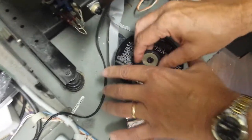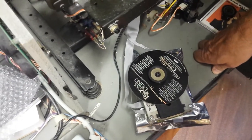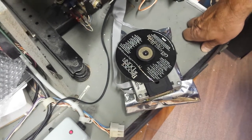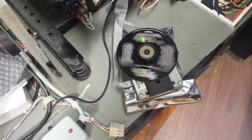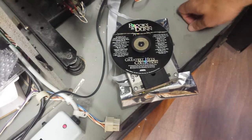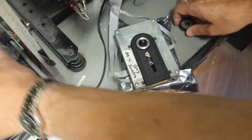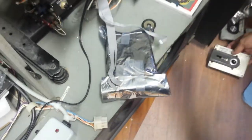We're going to put the CD back on and select the same track. You see what it's doing? It's stopping, spinning slow and stopping, spinning slow and stopping. It'll do that twice and then cancel the CD. That's a sign that you have a bad CD Pro player — it's probably the laser on this one. We're going to set that aside and move to the next one.